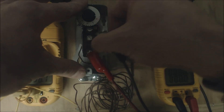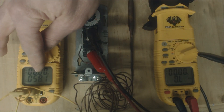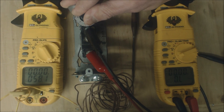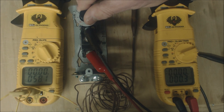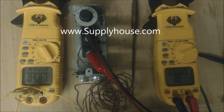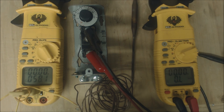Let's go ahead and check our red to yellow. As long as we have the temperature lower than what we have it set at, it should be open — but it's nowhere close. Once again it's closing at about five degrees and opening at about seven or eight degrees. So this temp controller is definitely off and we need to replace it with a new one or a digital one. Hope you enjoyed yourself and we'll see you next time at AC Service Tech channel.